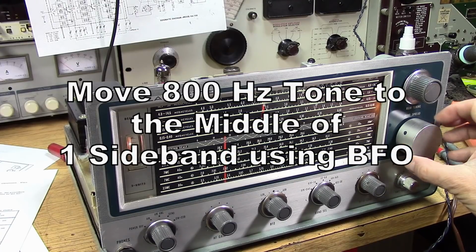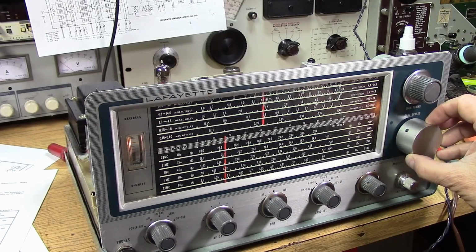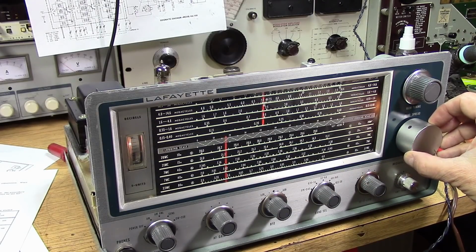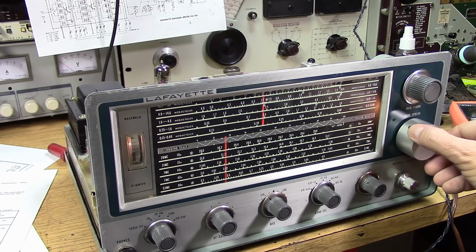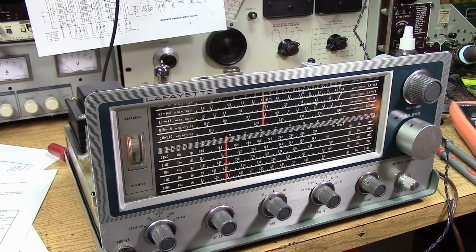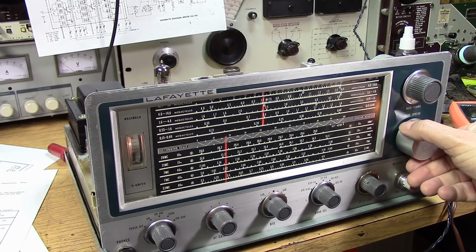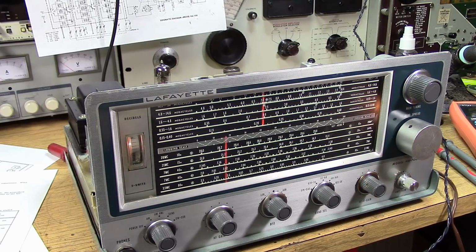Okay, so I'm biasing a little higher in frequency, lower sideband. Basically, I move the filter over a little bit. That's not perfect single signal selectivity, but for a novice, this would have been a good receiver. This is doing very well on 40 meters.